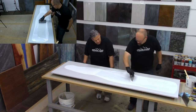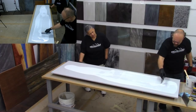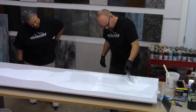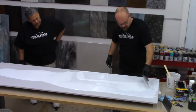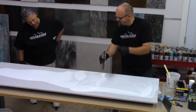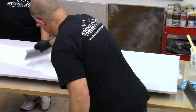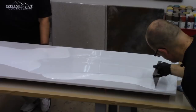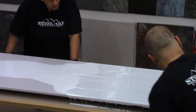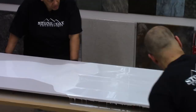I'm going to get everything close and do this half while you do that half. I'll do the edges after. I'm just using this trowel — see how I'm pushing a little bead right over this edge? That's important. We don't want to get too much over the edge, but that's going to start to run over the edges and give us enough material as we're getting close to the end. It'll get everything mixed properly. I'll go around front and do the other half. We have a little bit of extra epoxy and that's okay — we're going to put that back in our bucket so we won't push it over the edge.